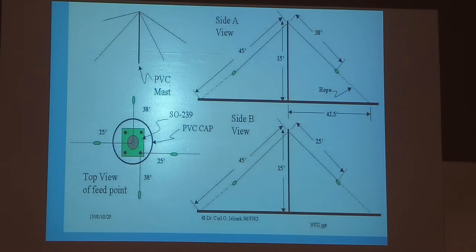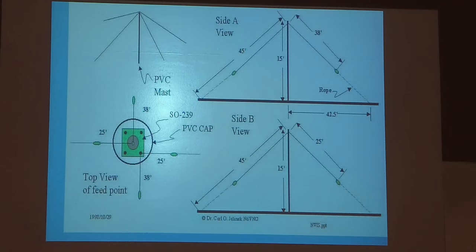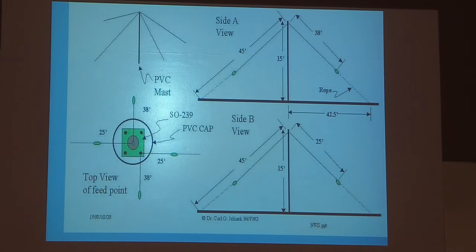And it's a good emergency antenna because in most cases, if there's some sort of disaster where you've got to go out there and set up your HF rig to talk from Memphis to Nashville, this would be a great antenna for that. Because you don't want it to go very far. You want it to go up and down. You don't want it to go out to Denver, Colorado. It's not going to help anybody out there. You want to get somebody in there. You can do the same thing with a whip vertical on your vehicle. You lay it over on its side like this, and you pretty much do the same thing.